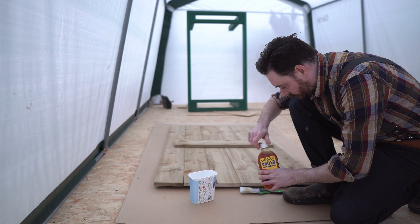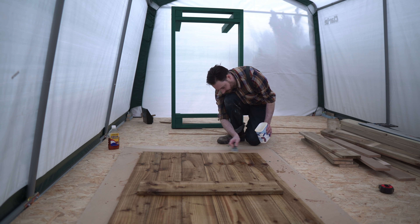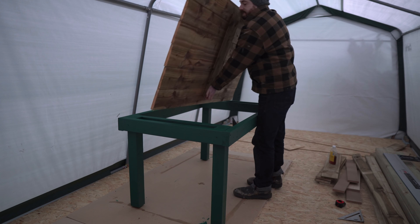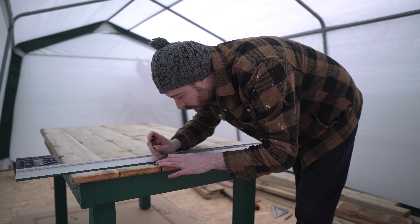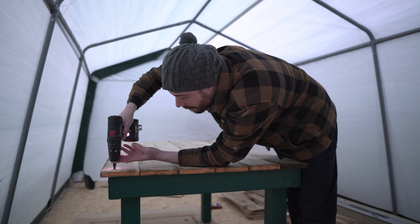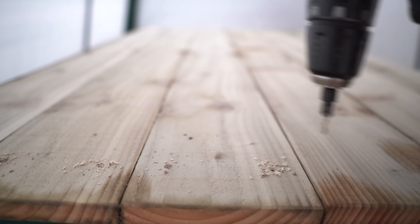For the top, because this is treated timber, I'm going for a cheap option — some boiled linseed oil. It's super cheap so I'm just going to get one coat on the underside and leave that to dry. Once the underside coat is done, I need to get the top attached. I could attach it from the underside but I don't mind the look of exposed screws, especially when done neatly, and this is a garden project. I use the track saw rail square to mark out all the hole positions, then use a little rule and an awl to punch holes three centimetres in from the edge of the boards, and use a countersunk bit to pre-drill them. Then I use the same 90mm long decking screws to secure the top down to the frame.